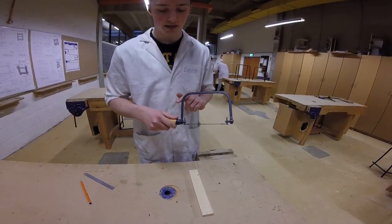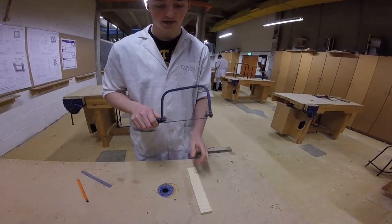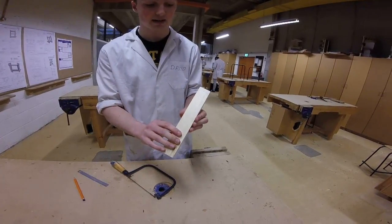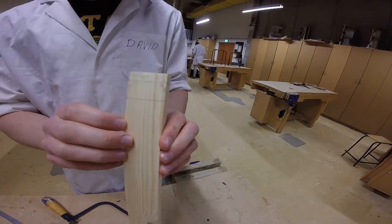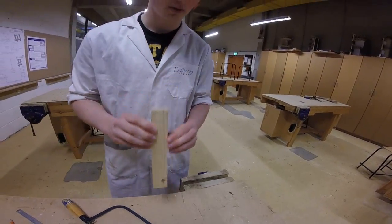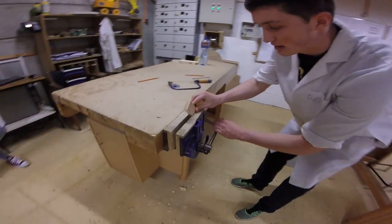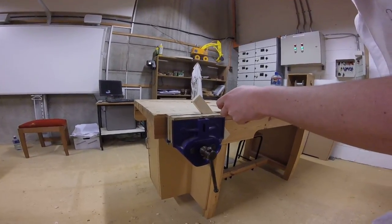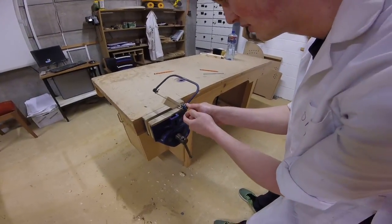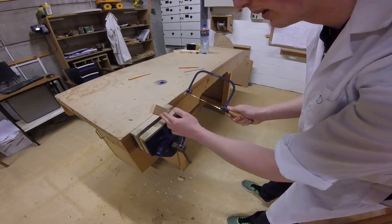This is my frame here and I've got my two pins which can be used to change the angle of my blade. I've got my piece marked out here with my curve — you can see my waist is marked here — and I'm going to show you how to cut that out. I'm going to secure my piece in the vise at a comfortable angle where I can use the coping saw and twist comfortably so I can start here and get a cut the whole way through.